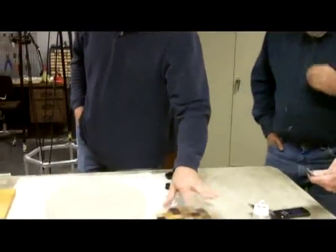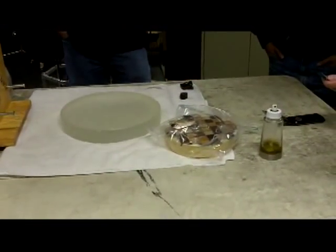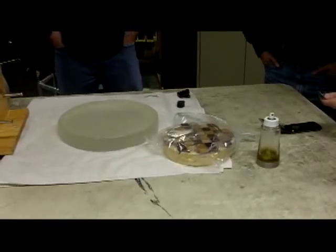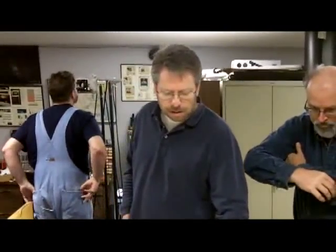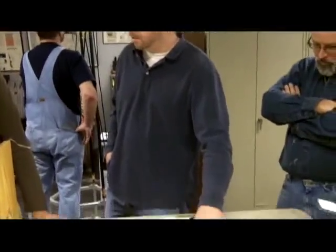Okay. And this was also a first for anybody that we know here, is that these tiles are glass. These are not ceramic tiles. These are the ones we built out. And which ones cut faster? I forgot. Well, the ceramic will last longer. They cut the same. They do cut the same? Mm-hmm. Okay. Yeah, because it's the grit that does the cutting. But the tool's going to wear out much, much quicker.